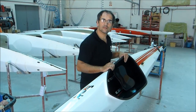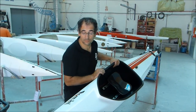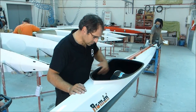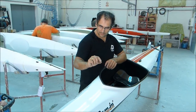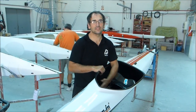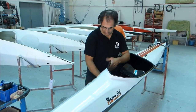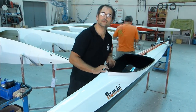Being that light, does it compromise the stiffness of the hull? It's very stiff. The only change for the ultralight version is the materials — more slim carbon and higher quality carbon, with more vacuum pressure. That makes it less resin and the same stiffness. There's a PVC foam core inside, two layers of carbon, or carbon outside and Kevlar inside, all with epoxy resin and vacuum.